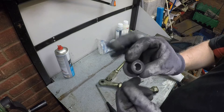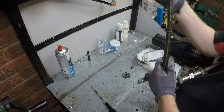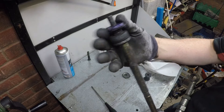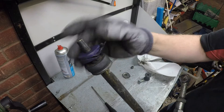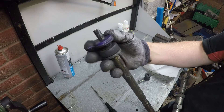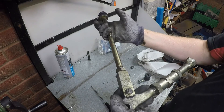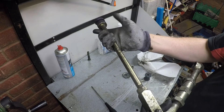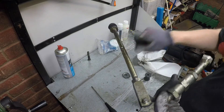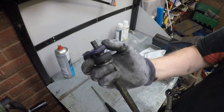The ball joints are in decent nick so we might end up keeping them. These ends here are where we're going to focus — you can see this is a polyurethane bush, the type we're going to make. You can see how it's spread and it's taken some proper hammer. That'll be from when the car goes into reverse very hard, because basically the wheels are pulling backwards on the body shell, and all of that forwards and backwards drive of the wheel is going through this front tie rod. All that force of banging it into reverse — yeah, that's taken its toll.